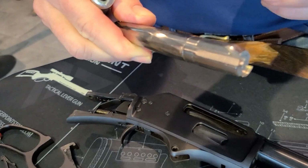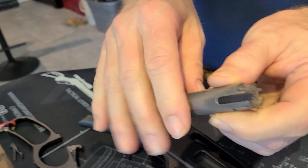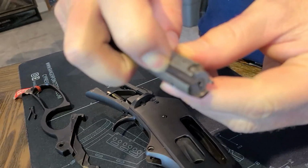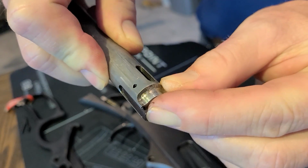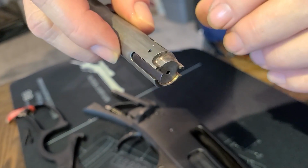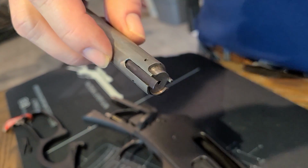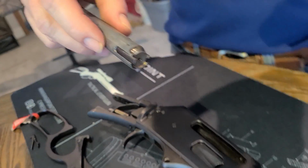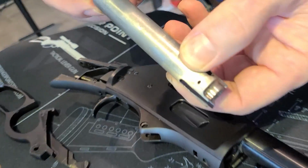So these guys do need to be tuned just a little bit to make sure they're not overly tight or overly loose. If you look at the Rossi one now, it's got a little rocker pin, and behind that rocker pin it's going to have a coil spring, so that extractor claw is going to be able to move in and out quite easily and consistently on that coil spring. And because the coil spring exerts a very constant tension independent of the shape of this thing, these modern setups like this just tend to offer a very consistent action that doesn't require any serious tuning. And so that's a nice feature for all of us. It just means that chances are when that thing leaves the factory, no one's going to have to mess with that extractor to get it working right.